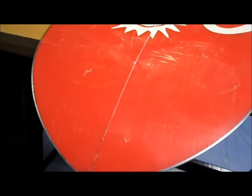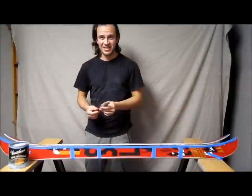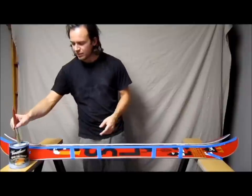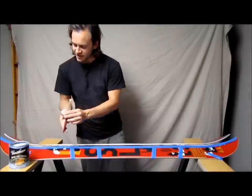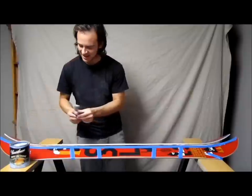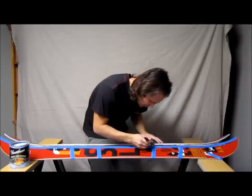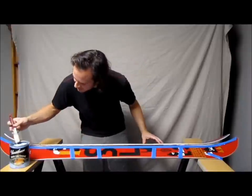The sanding is done — it's a very nice fit all the way down. Now I'm going to seal the inside edges of the board. I put tape on the top so I don't have to worry about cleaning the top surface. The board came pre-waxed so I can just scrape it at the end. I'm using spar urethane from Varathane — I've used it in the past and it works fantastic. Put it on the board in a nice easy coat, nothing too thick. I'm going to do four coats over two hours, basically every half hour, and that should be sufficient.